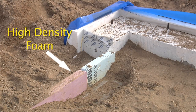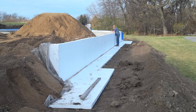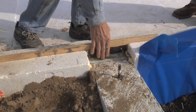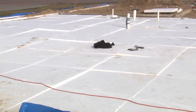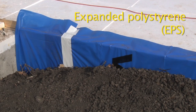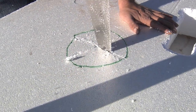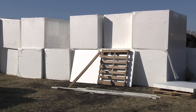The high-density foam is here, but the majority of the foam we're using underneath the slab and along the outside foundation walls is not necessarily high density. Typically this is 15 to 20 PSI rated foam. This foam here is rated at 15 PSI, but it's not extruded polystyrene — it's expanded polystyrene, or beadboard. We like using beadboard because it's a flexible foam. It doesn't break up under walking, traffic, or backfilling, so it keeps its integrity and gives us a good tight moisture and thermal seal.